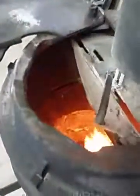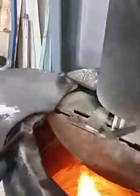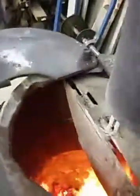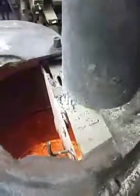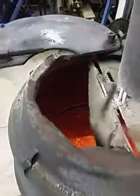And how it actually works is, when I made it, if you can see at the back there, there's a bit of a gap around here, so it can't be a perfect air seal, or else it's just not going to work. You're going to choke your fire. But I had a bit of plate. I cut the plate not quite in half, and made a split in line with the chimney here, and half of the circle goes there, and the other half forms the flap that comes to the front.